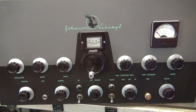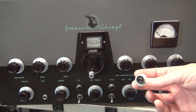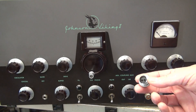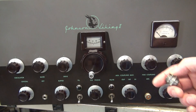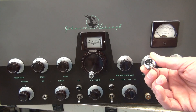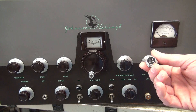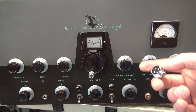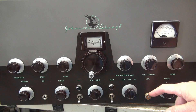Johnson had this nice 2-pin jack - you see these on the Rangers and the Valiant. The problem is they're made by Amphenol and they're very costly, so good luck finding one of those. There are some options. You can also install a typical 4-pin CB type input jack. They make these in a 4, and then the 5-pin type are for Cobra radios. But to install this type, or the Johnson 2-pin, you have to drill this out, so it does require a slight modification to the front panel.